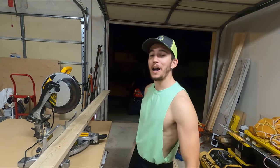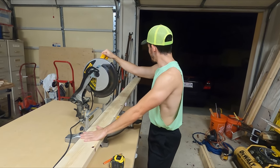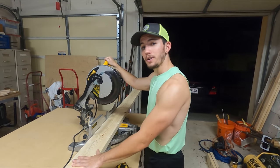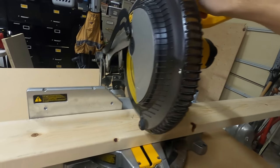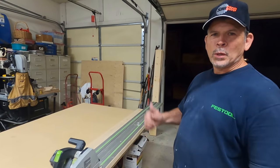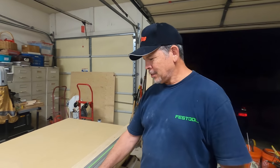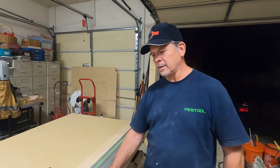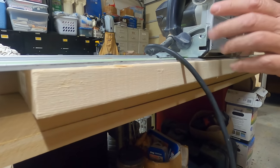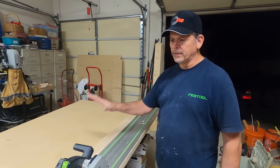It is the next night. It's really cool to come out here and create stuff after hours. We've got these 2x6s and they're 12 feet long — the idea is we're going to cut them right in half for a six-foot-long desktop. We have all our 2x6s cut in half. Now we don't have a jointer yet, but this track saw does a beautiful job of cleaning up the edge of a board. So we're going to rip one edge, get rid of these radius corners from the mill, and after that we'll have a nice crisp corner. Then we'll run it through the table saw.